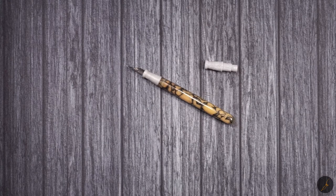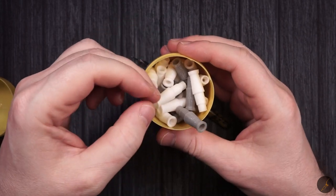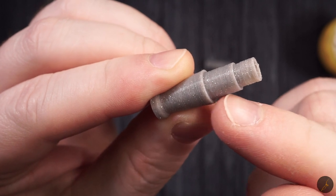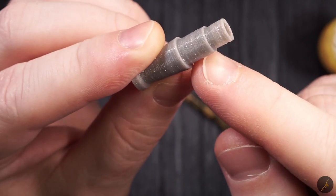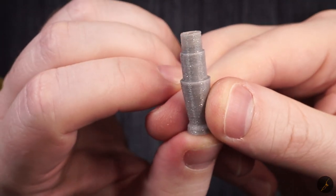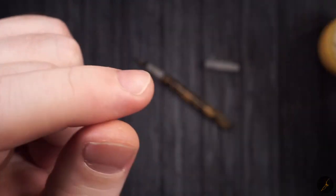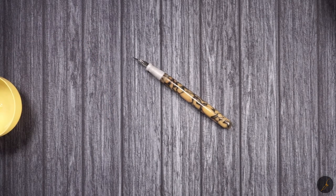Even if you end up, and as you'll see, I have a lot of tryouts that I've done over the years, even if you end up with a very decent looking part, there's still the problem that there's gaps between the actual layers, even if you go as small as 0.02 or 0.01 layer spacing, and you'll still end up with issues between them. As an example, you can cap the bottom, put water at the top, and the water will actually seep through the sides of the material. In order to prevent that, you actually have to coat the parts with resin.